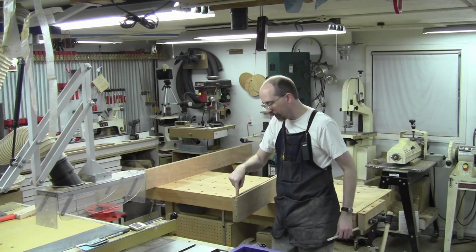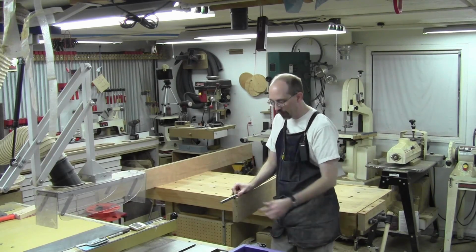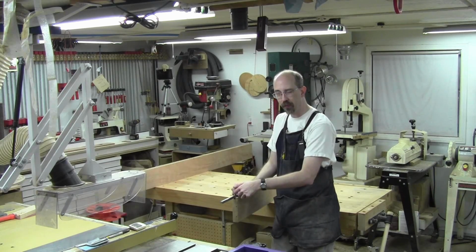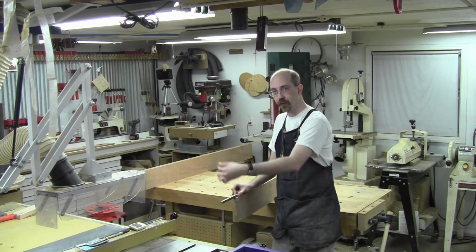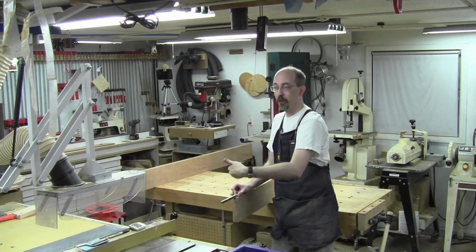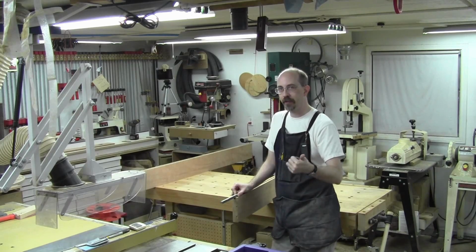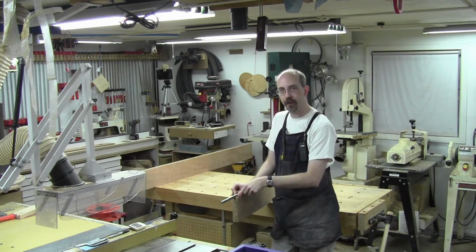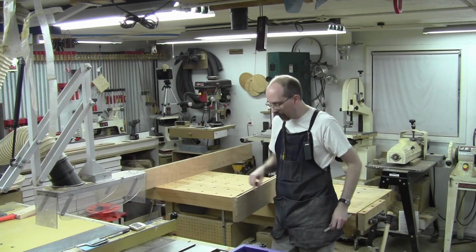And so I'll just put a pin down in this, cut this off a little bit proud from the top, and I'm going to drill and tap it for probably some 5/16 bolts. Then that's what's going to grab onto the sliding mechanism and hold the door. So the door will be hanging, but all the weight will be hanging on 5/16 thread, or the shear strength of probably a 1/4 inch diameter pin through this into the wood. So that's kind of where I'm at.